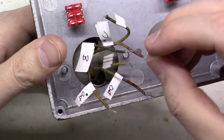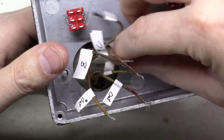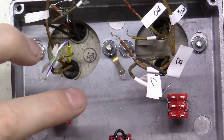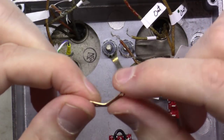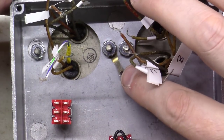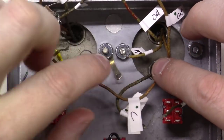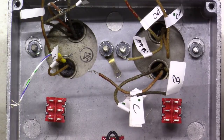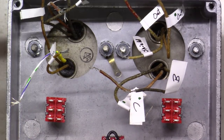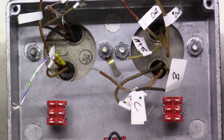I've routed all the wires — I like to use these K-locking nuts that have the built-in lock washers, really good for this kind of work. Got all four transformers bolted down. On the middle one I came along with a little chassis tag, available from places like Tubes and More or Antique Electronic Supply, to create a grounding point. I'll tie the shield wire from each transformer off to this point and solder it there. I'm trying to leave all the original tags on the transformers so someone down the road can reuse them without having to redo the pin-out work.